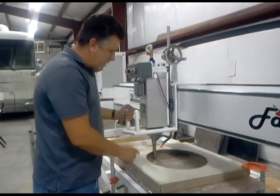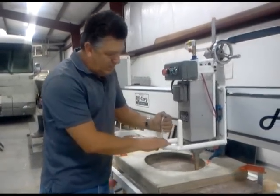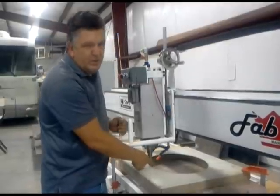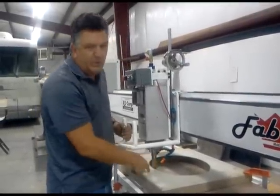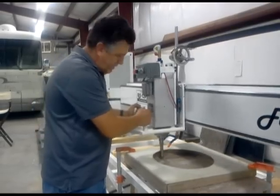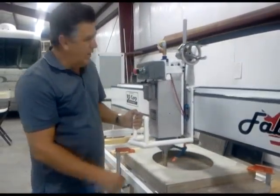During the cutting process, always keep the quill against the side of the template during the whole process. If you do not keep it against the template and you let the diamond just stay in the groove, it will eat the silver sleeve that holds the brass sleeve up, and you'll be replacing it. So make sure it stays against the template during the whole process. Again, this is just as boring as watching NASCAR with no wrecks.